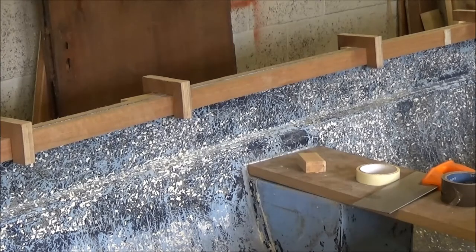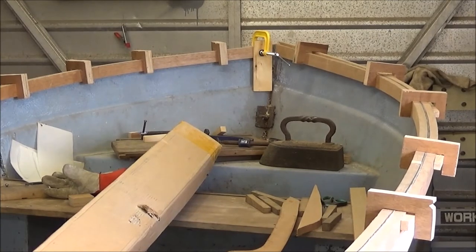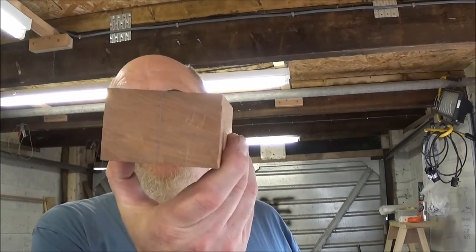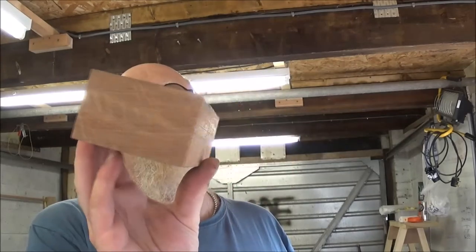There's something else as well before I do that. Up in the prow there's a block of wood which was shaped and put in there — it was completely rotten and it's actually two lumps of wood together, shaped to go into the prow and fix the inwales. That's just extra support for them. I've made up a rough block for now. I've put some pencil lines on it and used a sliding bevel as a rough outline, then I'll offer it in to place to get the final bevels and plane it to fit.